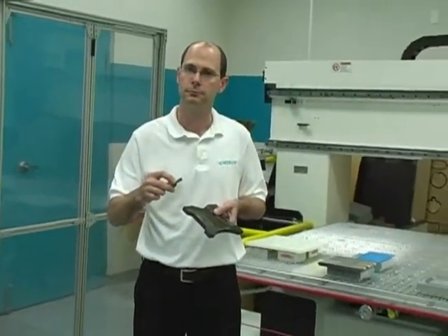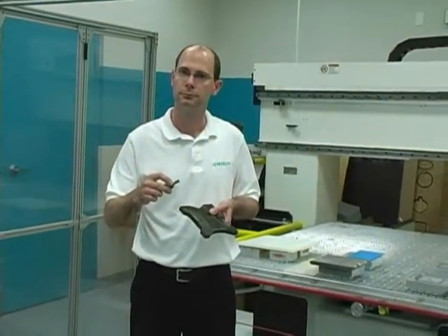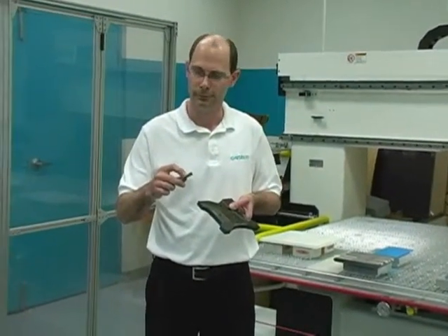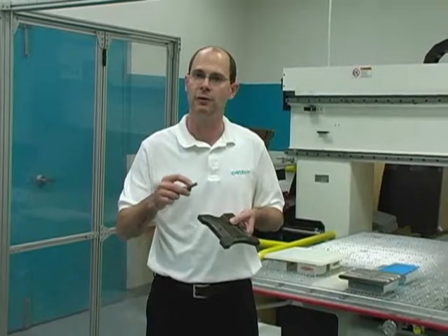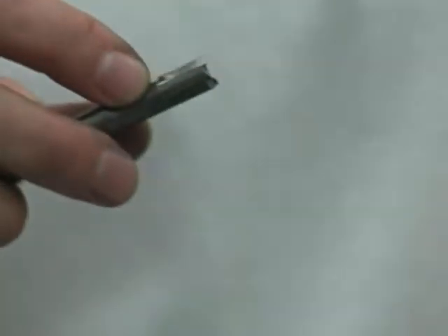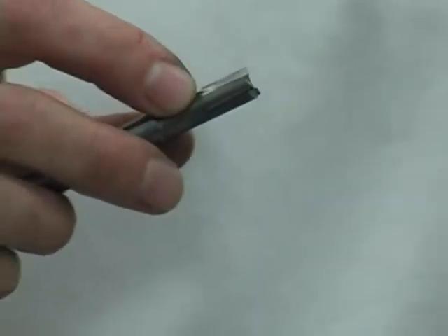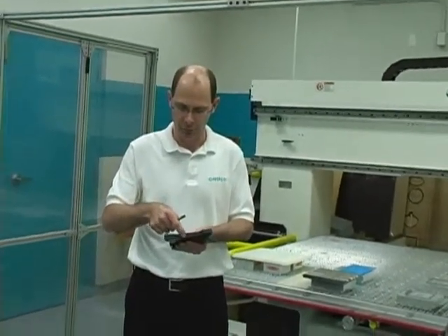The advantage of the roughing edge with the sine pattern is like any traditional roughing tool — it shears the material. What are some of the advantages of that roughing pattern? It shears the material, but it also lowers the cutting forces, which allows you to feed the tool faster and also achieve longer tool life. As you can see from the close-up, it has a sine wave — a wavy pattern — so that wavy pattern is going to end up on the edge of the material. You run your finger down the edge and you can feel the slight ridges that are left over.